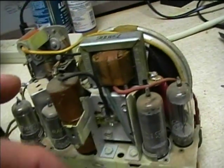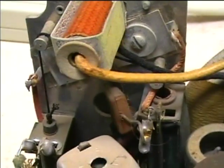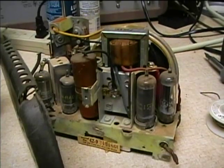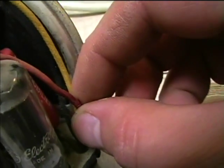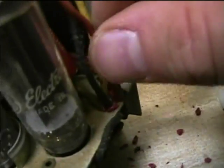But this is a full-featured superheterodyne 5-tube radio, just in a miniature package. It uses variable inductors for tuning. They're the inductors for the RF and the oscillator stages. There's an old electrolytic cardboard case capacitor. So we'll just replace, or fix, the usual problems on these old radios, which is bad capacitors and bad wiring. Right here you notice brittle wiring on the output transformer, brittle rubber wiring.